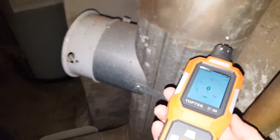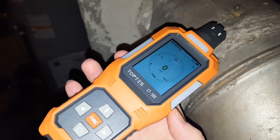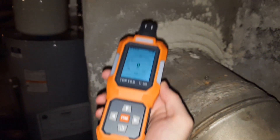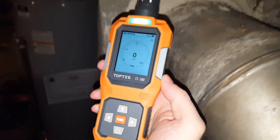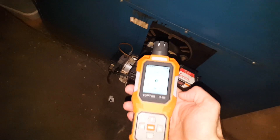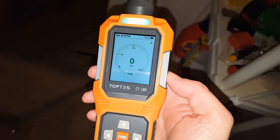Just testing the air over the boiler, tested the connections, tested the vents and ventilation — making sure the ventilation is not blocked. If your flue is blocked, if you have animals or foliage up there, some of those gases might not be leaving and they might be lingering. If you have an improperly installed furnace or any holes in the connections, that could be causing it. I didn't see even a single part per million, so it's pretty good.